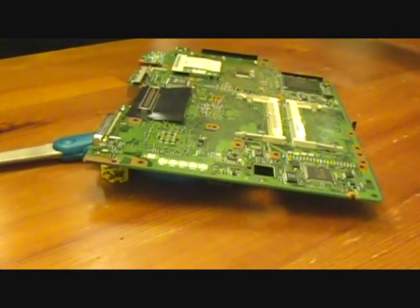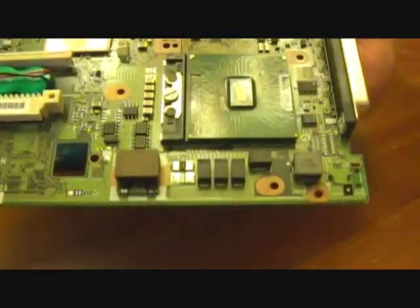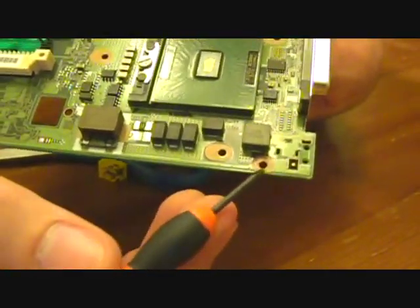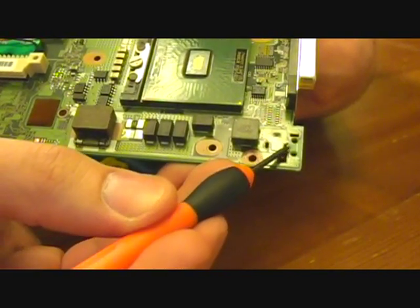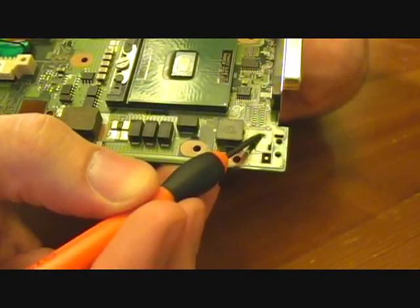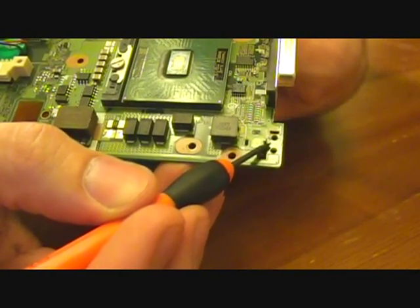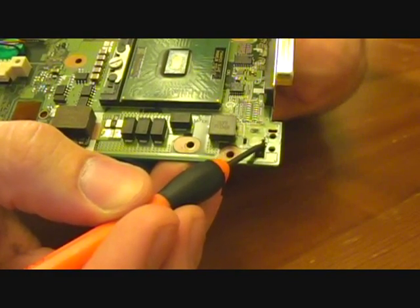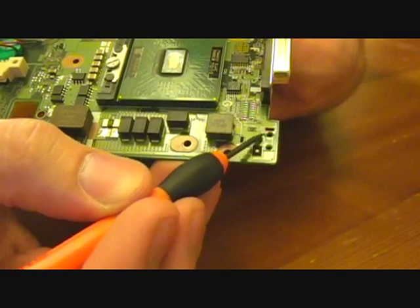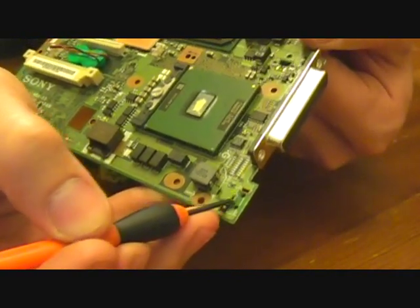There we go. Now let me show you — I don't know if you can see it. Around this board, we've got little spots where solder can stick on this side of the board too. You can see there's some solder right here, and this one right here is under the plug. So you'll have a little bit of solder sticking here, and if you force it out without heat, sometimes it will just rip this part of the board out.